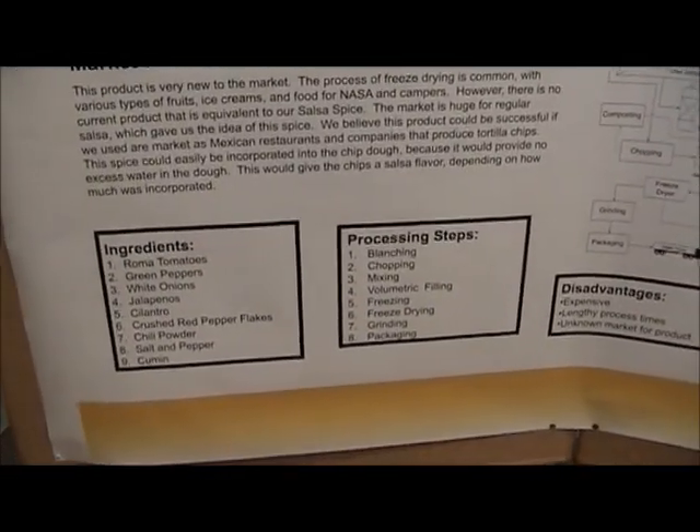What aspect of the project was most challenging to figure out? The first thing is trying to estimate the freezing point of the product, because you have to freeze it before you even put it in the freeze dryer. Because our process has at least 10 different ingredients coming into it, you have to account for all that and try to calculate properly for the freezing point depression. Then actually being able to figure out our own special recipe for the freeze dryer — it's a super long process, it takes almost two days to do that. Being able to do that and figuring out all the energy we have to put into it — that's probably the biggest challenge we've had so far.